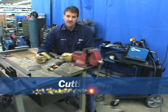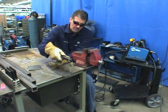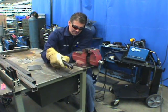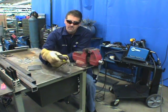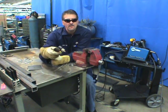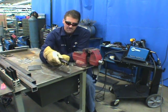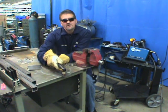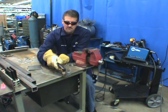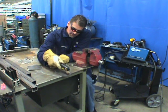No warping at all. Now I'd like to show you a little bit thicker material, because our plasma cutters do cut thicker material as well. When you're using an extended tip like this, you want to hold a little bit of a standoff and get as close to that material as possible. Put your finger underneath the safety, get close, pull, and make sure that you have this hand as a guide to trace that cut. On thicker material you want to hold the standoff when possible — that'll make your tip and your electrode last a little bit longer.